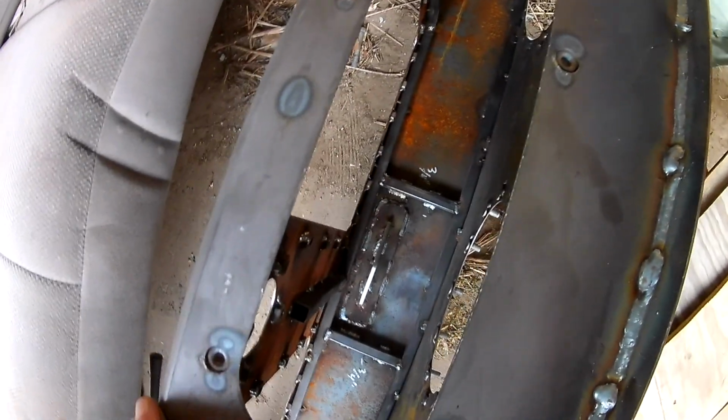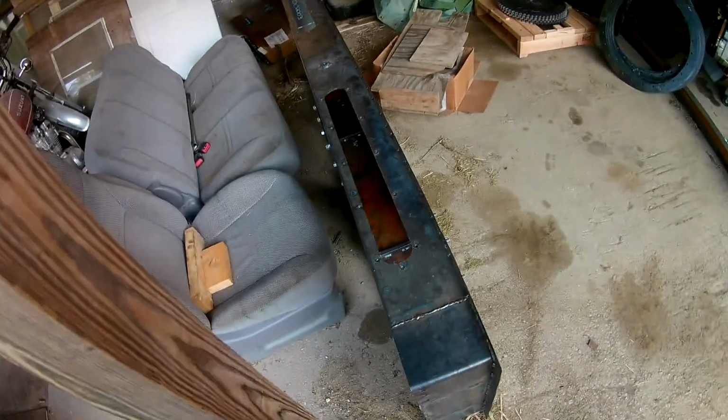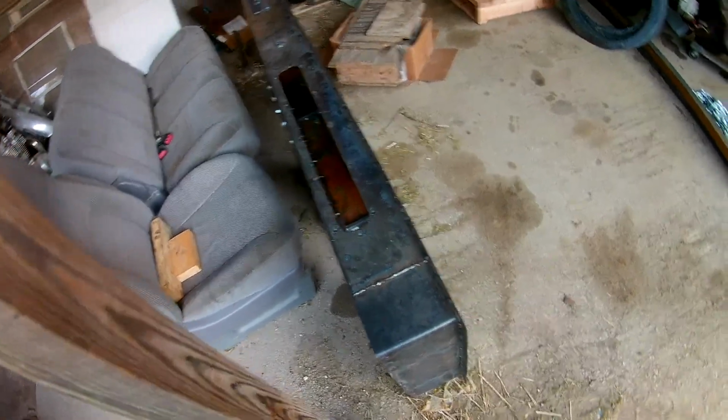Yeah, the welds aren't that beautiful, to be honest. I was kind of rusty with welding for a while there. But I did 3-inch backstitch passes, kitty cornered every one, just to make sure that, if you just burn a single line down here, it would probably potato chip like hell. But overall, I'm pretty happy with the straightness of it all. It didn't really distort too much.